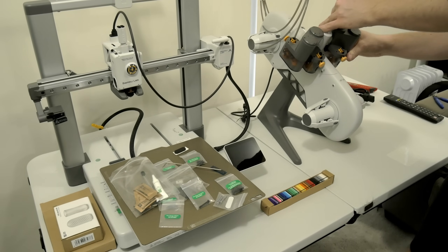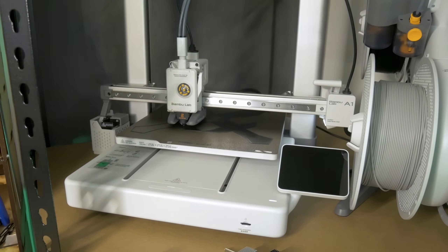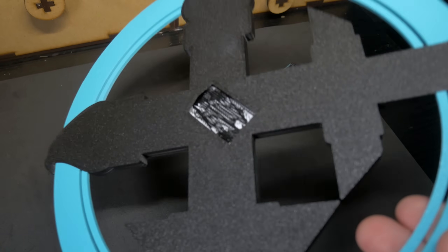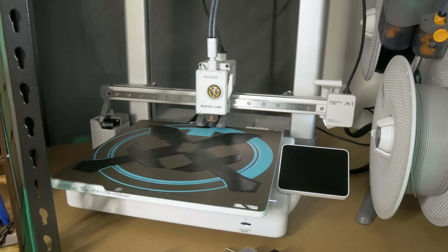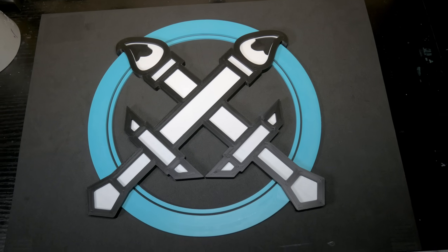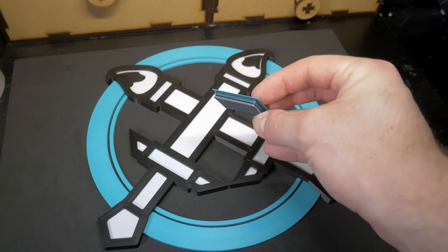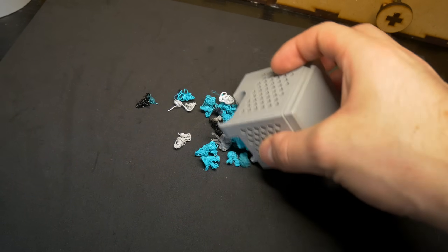Multicolor printing for this price tag is a very exciting concept. I was able to load up a custom 3D model of my logo, sync up the filament colours from the AMS, and use the fill bucket to determine where I wanted colours to be on the model, then sent it straight to the printer. I had made parts of the model far too thin and forgot to support some areas, so I had some rough patches, but the A1 powered through and produced a phenomenal multicolor print. Multicolor prints do take a little longer and require you to print a purge tower to prevent colours bleeding into one another, producing a lot of that printer poop — this simple print with only 32 colour changes filled the little basket with plastic.